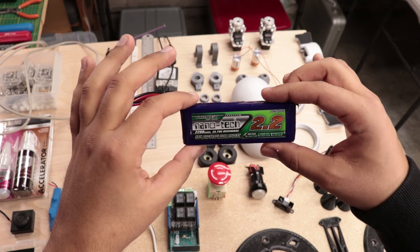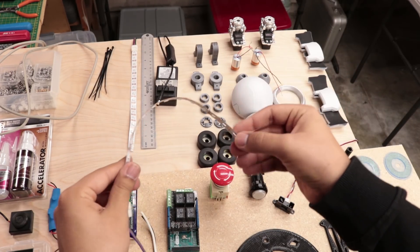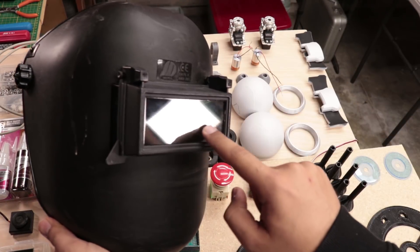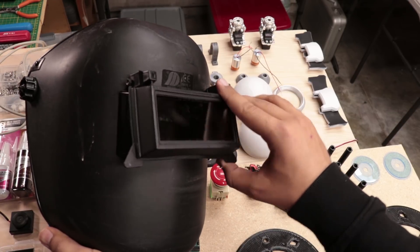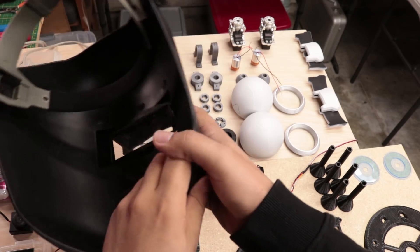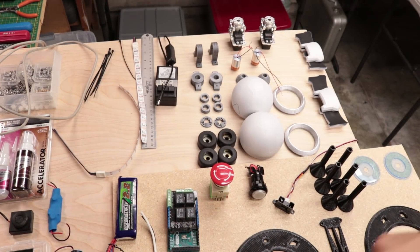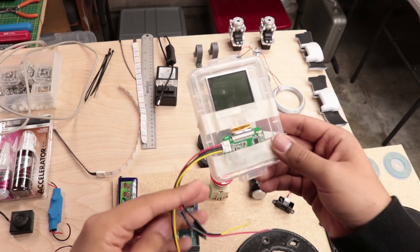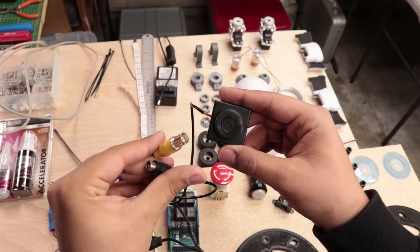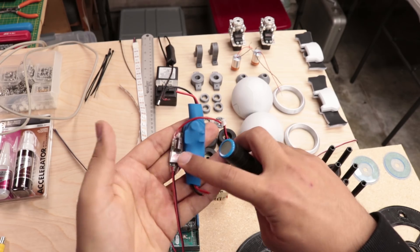The whole thing's controlled by an Arduino mega and a relay shield, because these lasers actually draw a fair amount of current. The lasers run from six to nine volts, so this two cell LiPo battery will do the trick. Inside, there are going to be strips of RGB LEDs so I can get the teal color. Last but certainly not least, I'm going to be turning this welding helmet into my own version of FPV goggles. This viewport does nothing to protect my eyes from the wavelength of light the lasers emit, so I'm going to be completely masking it off, putting a camera on the outside and a little LCD on the inside so I can safely view the laser beams with absolutely no chance of it getting to my retinas. I'm using this little LCD screen for the interior, this camera to provide a video feed, a battery to power it all, and the corresponding power circuitry to power the screen and the camera, because they need different voltages.